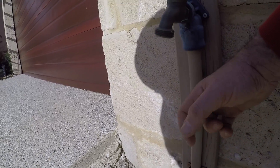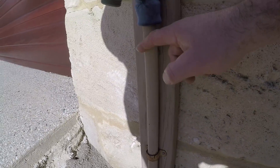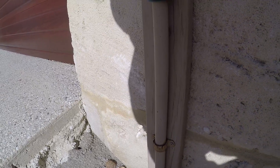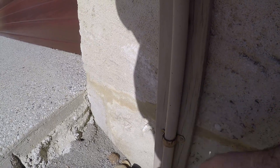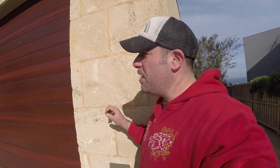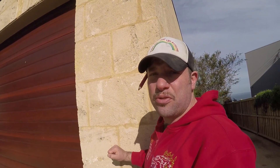You've got a bracket — that's plastic. You are not allowed to have plastic coming up from the ground; that needs to be copper. You can see it just rusting. The salt water has just gotten into that and it's just popped off as the steel expands from the rust eating into it. This stone here is Hawkesbury stone, or what's called sandstone — really top-notch stuff for around the oceans.